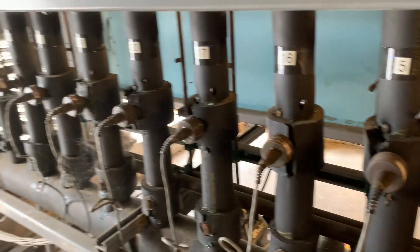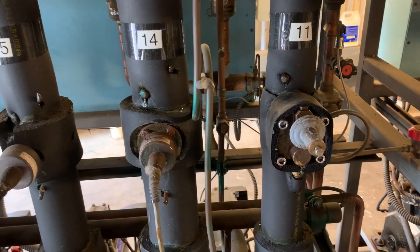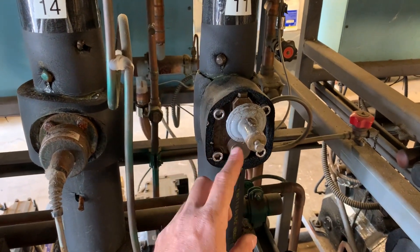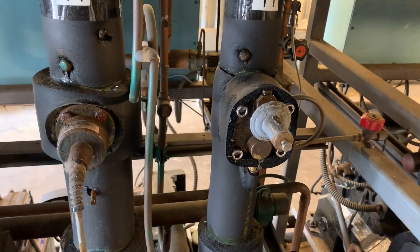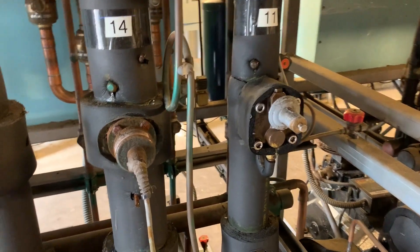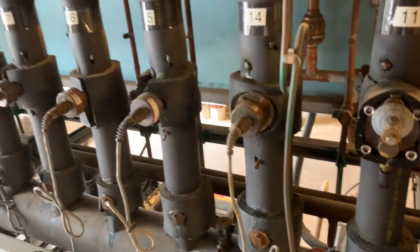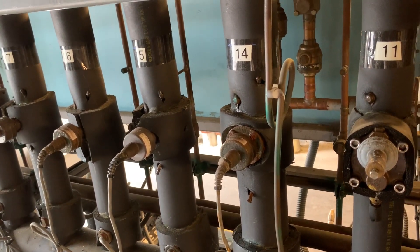Now the suction pressure has to be below your coldest evaporator at the main suction header in order for this strategy to work, so there's usually a little bit of wiggle room — it'll be a little bit below what you're going to run your coldest evaporator at to allow for any variation. But that's the basic idea of what we're trying to do: throttle the suction gas to control that evaporator pressure to just maintain a constant steady temperature on the load.